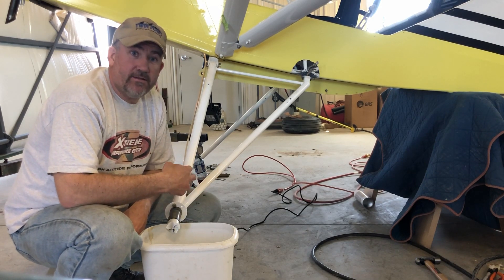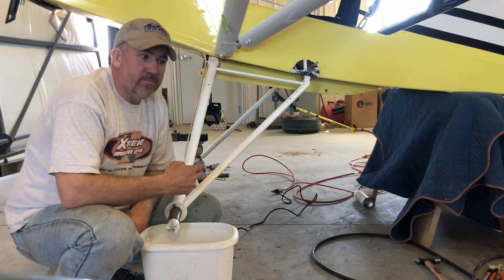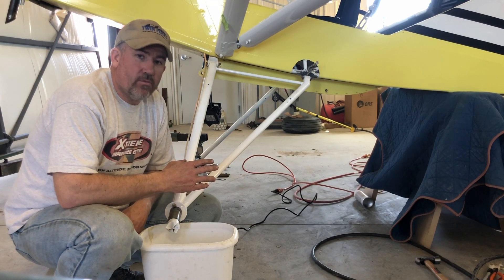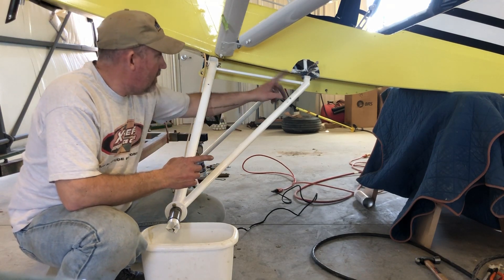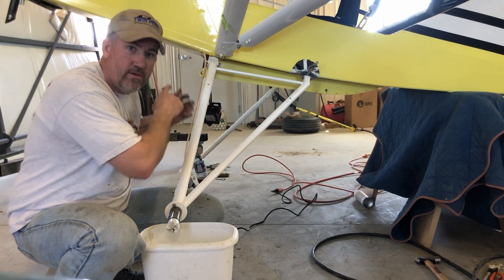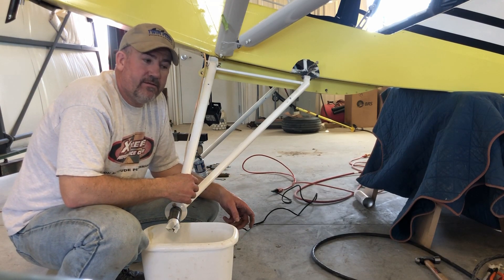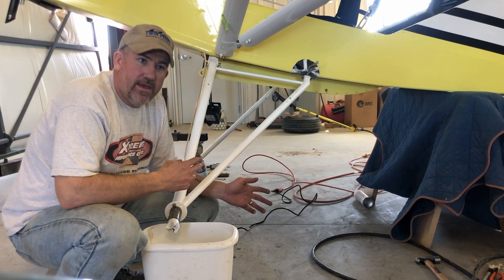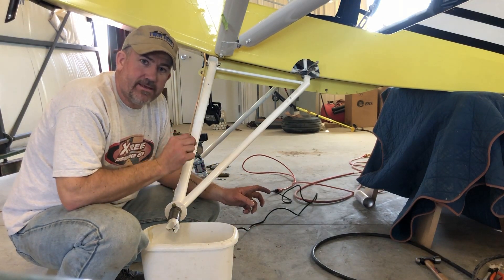John Roberts, who builds these kits, does an awesome job and the fabrication is incredible. I thank you, John. But either I misunderstood the instructions or they're written for somebody more precise than me. Because John has you weld this rear tab on, and then drill and fix in place your front gear leg. And the way I did it the first time, either something moved or I didn't drill the leg quite properly, and it just created a lot of fighting over that last sixteenth of an inch.